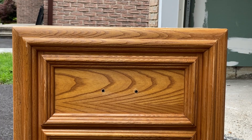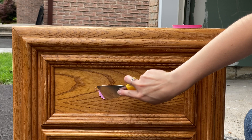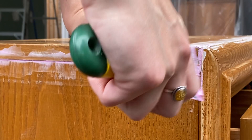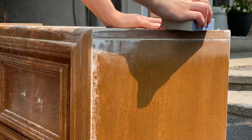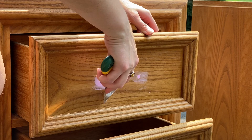Finally, I just had to fill a few holes and areas that were damaged. I used a couple of coats of spackle with sanding in between to fill the old hardware holes and some of the cracks where the pieces of wood met. I think filling these cracks is probably not necessary, but it will make the entire finished piece feel more substantial, elevated, and clean. This product sands really easily, so you only need a light hand and a fine-grit sandpaper to smooth it out. If you have bigger areas to fill, it may require a few coats to get it really flush with the rest of the surface.